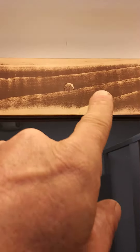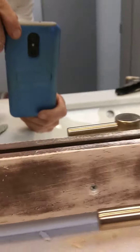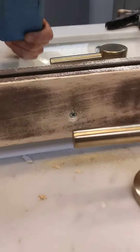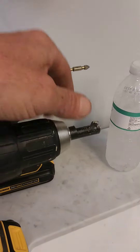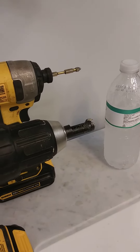And there's another one. Don't look too bad. I'm getting ready to do this one at the bottom run, and I got one over to the left of me. So I'm going to use my plug cutter to make the plug I want out of the same kind of wood, and then I'll glue that in over the top of the screw.